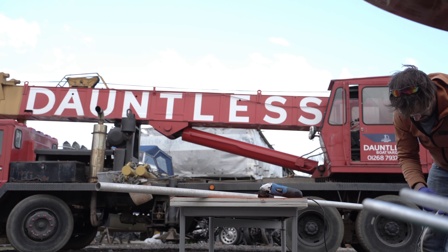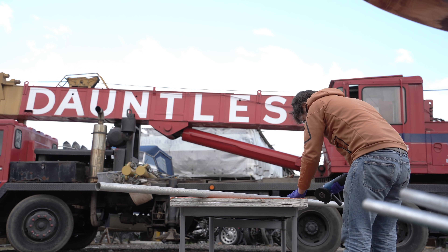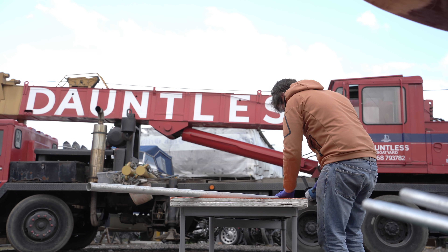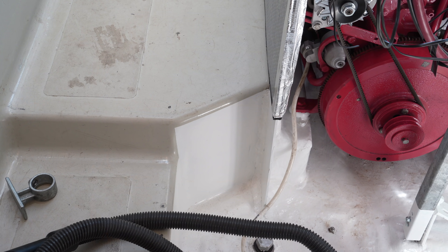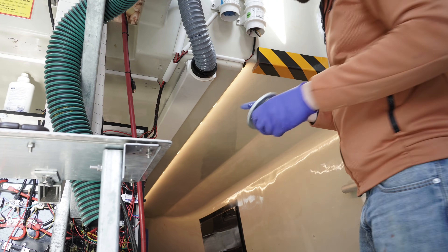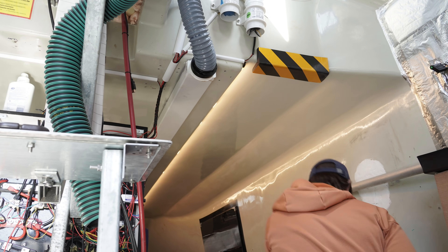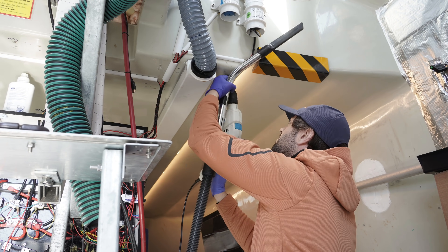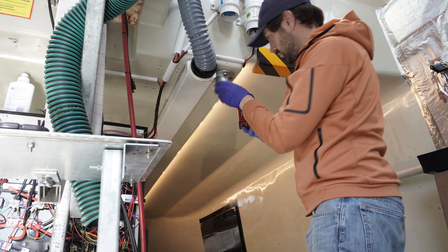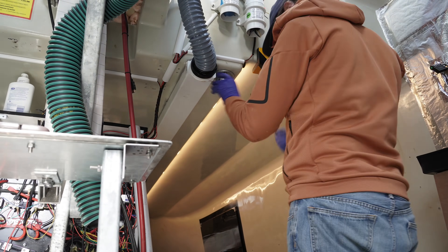So I'll settle you down with an extra job I wanted to get sorted. As you walk from the stern helming section of Alan into the living, storage, and fuel racking zone further forward, you'll likely want something to grab onto to steady yourself — and I don't want anyone falling into the electrics panel. So I earmarked a couple of robust fiberglass surfaces and went in search of spare tubes from the railings on Alan's deck. This wasn't much more complicated than fitting a couple of railing brackets and sliding the tube in, locking them with grub screws. But it's a reminder of how careful you need to be when fitting bolts or screws into fiberglass — you only get one shot. These were blind surfaces so I couldn't use bolts; rivets would have been too narrow and too permanent. I used heavy-duty large-pitch screws — there are charts online, but different screws need different pilot holes.